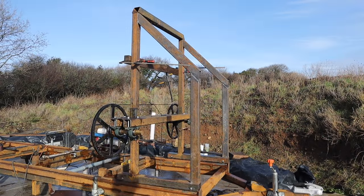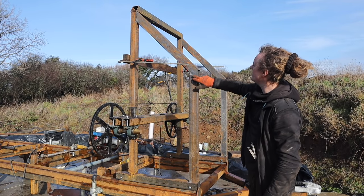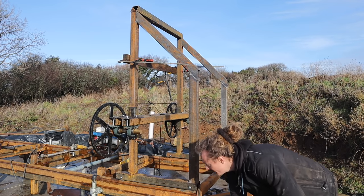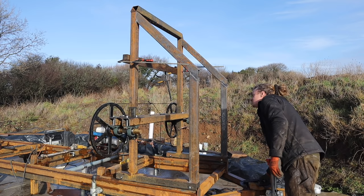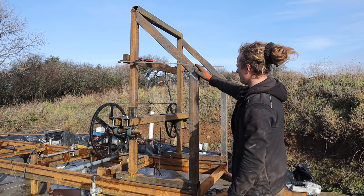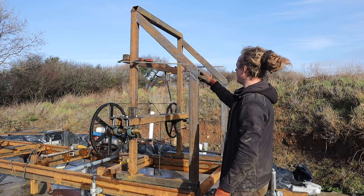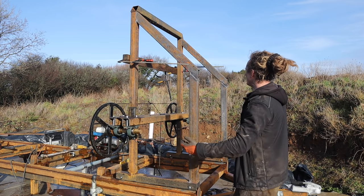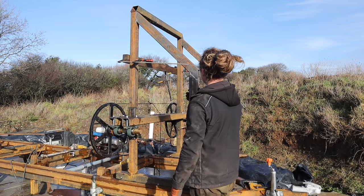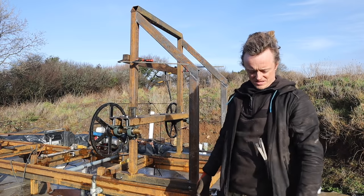Alright, so I've got my two sides tacked on, welded permanently there. The top isn't welded because I think I'm going to put some pulleys in it for the raising and lowering system before I weld it on, so I can do that on the ground. I think I'm going to work on that next, so that I can take these clamps off and we'll have a raise and lower, which will be helpful for building it because I can move it up and down. At the moment I've got to manually lift it, so I'll work on the raising and lowering next. Let's work that out.